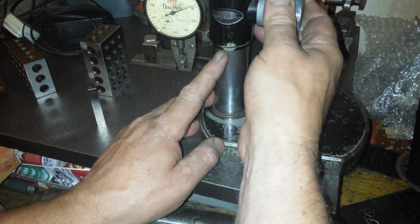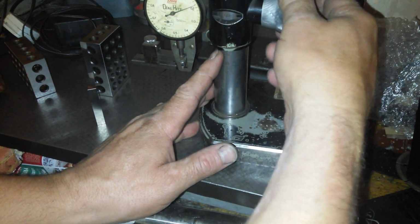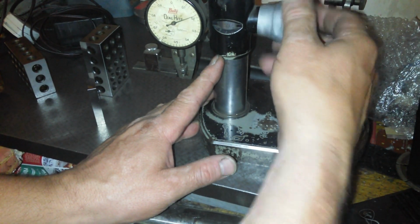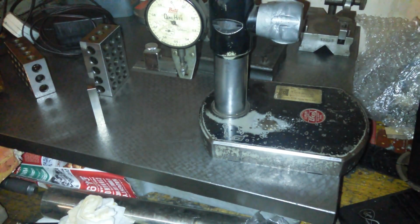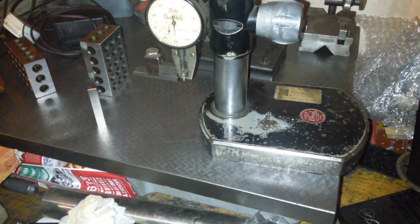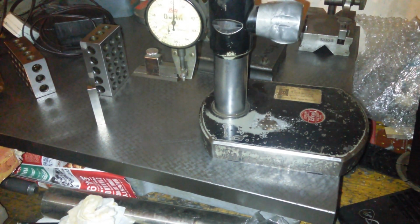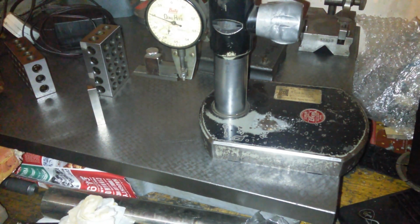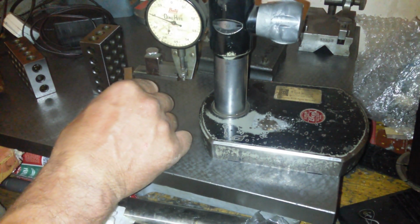25.4 times 2 is going to be, no, stupid boy, 25, it's going to be in the 50 scale. Okay, we're in the 50 scale. And we can wind this back up to 0, or wind it down to 0. So that's 50. You can see the scale there, that's 50. And we need 25.4, so that's 50.8. There's 50.8. This gauge block should go in at that.